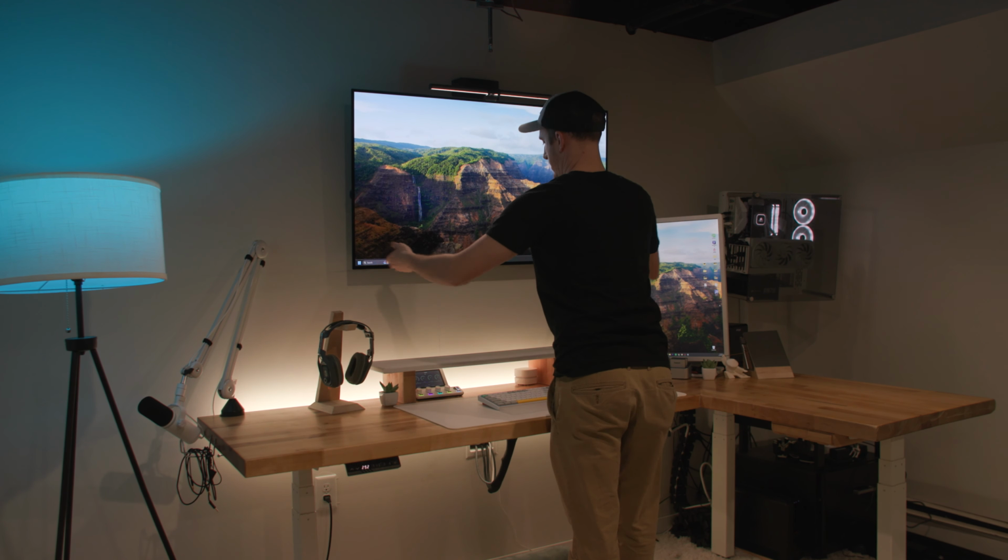Because the size of the opening where the door for the storage/IT closet would go wasn't standard, I ended up building a custom frame out of 2x4s and buying wooden slat panels online to make a door. To finish it off, I bought some barn door hardware and mounted the door to slide along the wall. I boxed in the lolly column and finished it off with some sheetrock. At this point, the basement is really starting to come together.